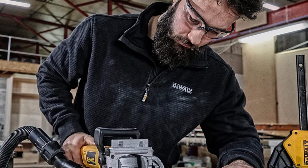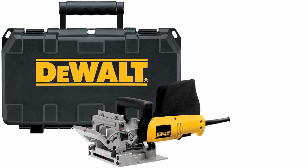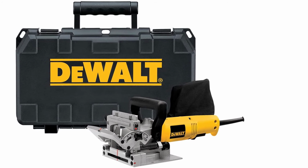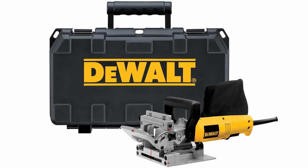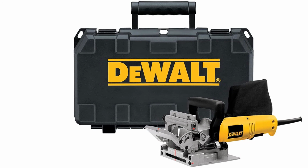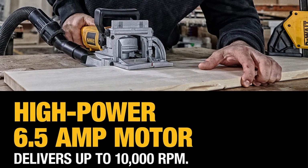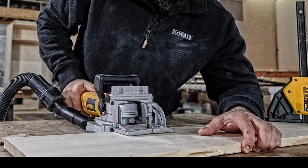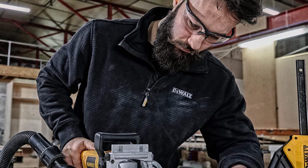However, note that the joiner's inability to pivot to 135 degrees and the lack of depth stops for less common biscuit sizes can limit the applicability of this joiner for professional woodworkers. One advantage that users loved about the design of this joiner, though, is that DEWALT's dual rack and pinion fence make it easy to ensure that the blade and fence are always parallel for the perfect cut, and the fence does not need to be removed from the joiner for making standard cuts flush to the wood. However, a number of customers note that the housings on some models have too much clearance, resulting in compromised alignment.